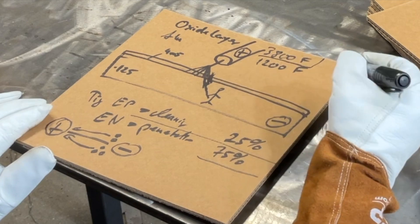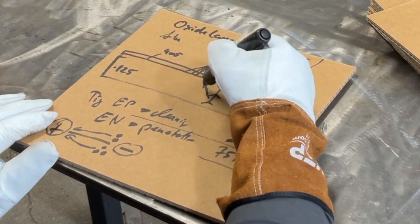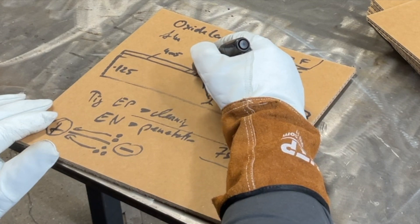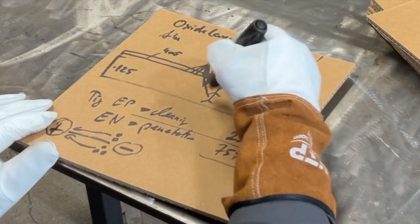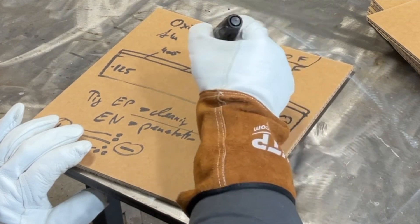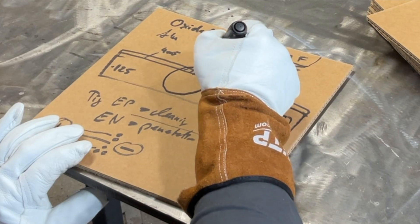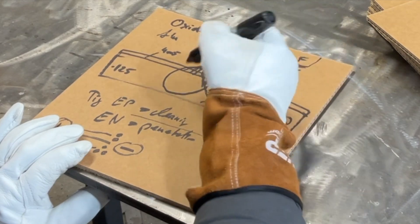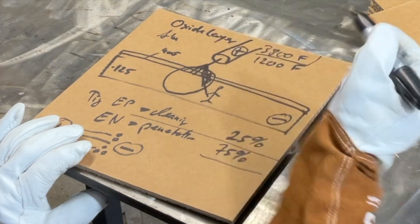The problem is that still heats up the material. As the droplet comes down into the material it still needs to break through that oxide layer for the electrode positive — the electrons from the inside — to blast the oxide layer away. And as this big droplet comes down it saturates this one-eighth inch material. This is your molten puddle, your weld nugget. It saturates that one-eighth inch piece basically all the way through just to get rid of your oxides.